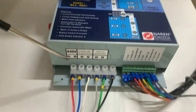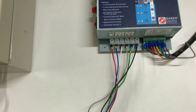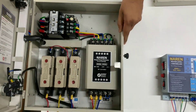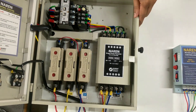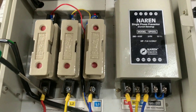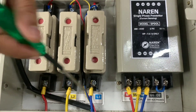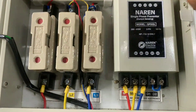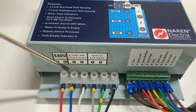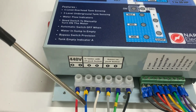The first two connectors from the left-hand side are for the 440-volt auxiliary supply. Have a look at your starter — the starter always gets its input from one of the input terminals. You need to tap a wire from any two of the three input points and feed it as input to connectors 1 and 2. We have taken wires from R and B, basically positions 1 and 3 from the starter, as the auxiliary supply for the water level controller.